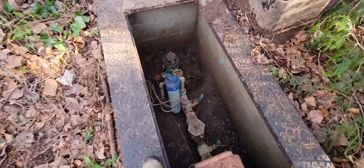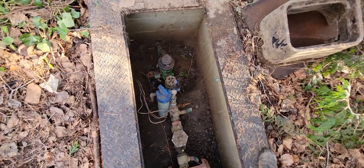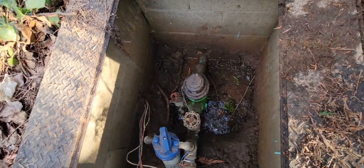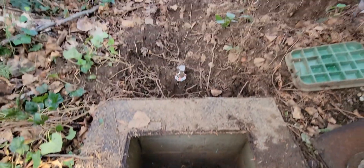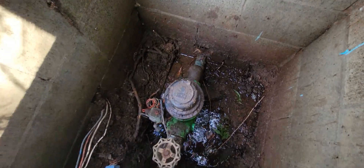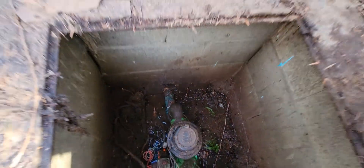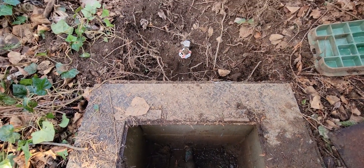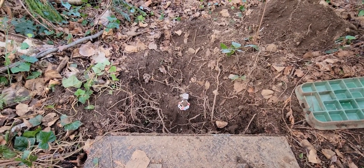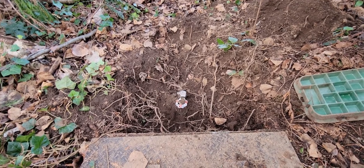Here's the project: we have this old hydraulic system, and that's not going to change — it's still going to be hydraulic. But the master valve, called Bermad, is going to be removed. I'm going to be putting another master valve on the outside. This is all brass and copper, so this thing has to be spun off. I'm going to replumb down, follow that copper out here, and put a new Rainbird master valve. Up here we're going to have a flow sensor.